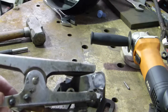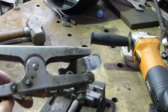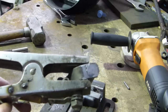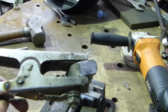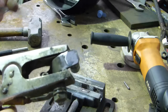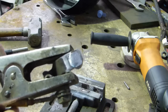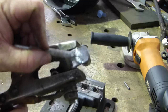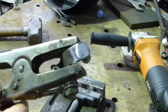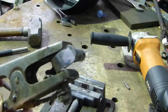There's where I welded it. I noticed as I was three quarters of the way through the weld that it was spattering a lot. And what did I do? Had a bit of a bozo moment - forgot to turn the gas on. I'm just showing you this: even though you can grind the weld back a bit and you think it doesn't look too bad, see these little air bubbles here? That's because the gas wasn't on. So anyway, we're going to have a big grind and we're going to do it again. Lucky I'm not charging by the hour, eh? I'll have to bloody sack myself shortly.